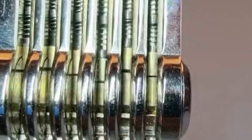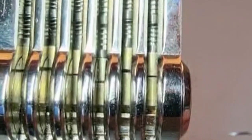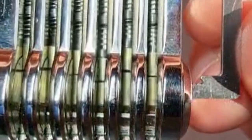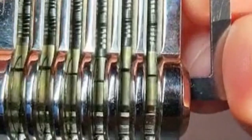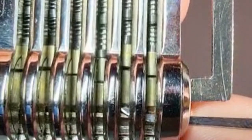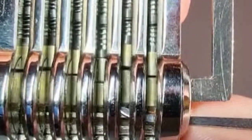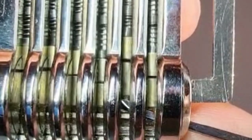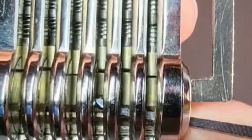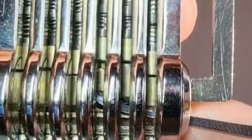Okay, so here's a cutaway lock. What we've lost in definition, we've made up for in scale. So you'll be able to see all those pins. First thing, always do, just go through the lock. Check all the pins and springs are working. A bodged spring or a dodgy pin will send you insane. Make sure it's all working first. I put my top of keyway tension tool in, a bit of clockwise turning pressure, and then I'm looking for resistance. One springy, two's maybe, but I'm not convinced. No, it's still springing. Move on to three. That's binding. Three is without a doubt binding, a little bit off the tension, that's set.